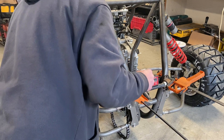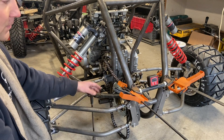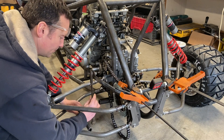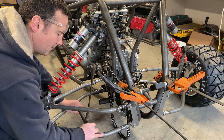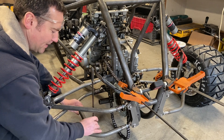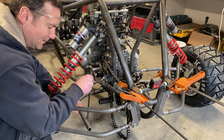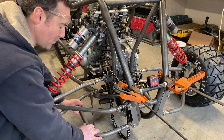Once you get this on level, we're going to drill holes right through this tubing, but we're going to weld in the bolts so they won't lose much strength. Then we'll get our cross-members in place, weld some tabs onto there, cut these to the appropriate length so this is level, and then tap or die new threads onto this end link for the appropriate length. And then we will have a functional sway bar.